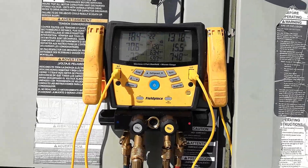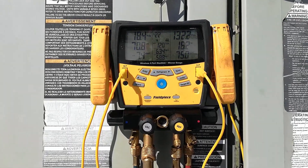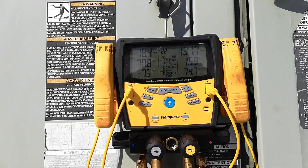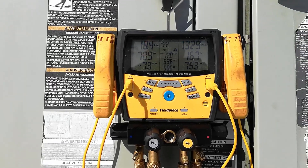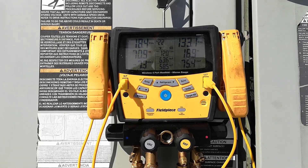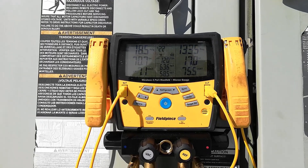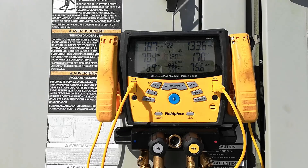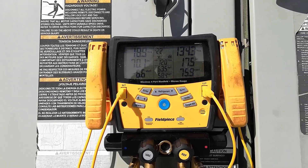The unit's only been running for a minute, but it's already slammed shut. The TXV is slammed shut — not letting any refrigerant get through to the evaporator. The evaporator is actually acting like a freezer right now, with negative 7 degrees of saturation temperature. So we definitely have a restriction, or it's stuck, or the sensing bulb's not working anymore.